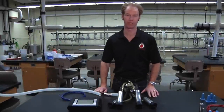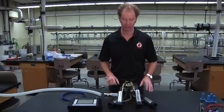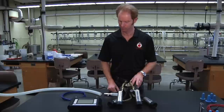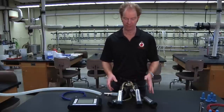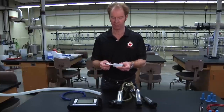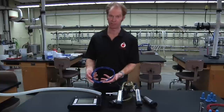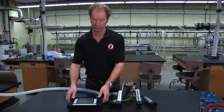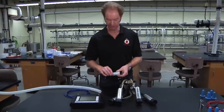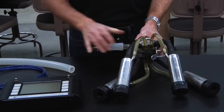This test is looking at average claw vacuum, and this is a milking time test, so it's done during the actual milking process itself. For the purposes of this demonstration, we're just going to imagine that this cluster here is attached to a milking cow. The equipment that you need for this test is the cluster itself, a short T-piece — stainless steel in this case — attached to a cut-off piece of milk hose, and a short sensing tube, which attaches between your T-piece and a standard vacuum recorder.